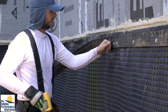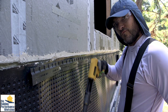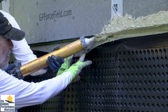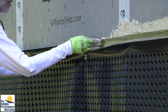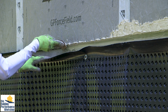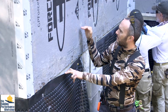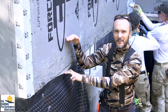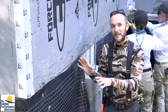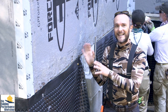But the fastening process of this, which involves a powder-driven nail gun — and it's very fun and very permanent — couldn't be done until we had sealed this seam for air and moisture transport. And this couldn't be done until we had the roof on and the house all dried in so that water wasn't getting in there. Because you could see that in some places the water was getting in, sitting on the floor, and then coming out and soaking these panels. So you can see the bottom portions of these in some places look a little bit beaten up. That's stopped now because the water is not getting into the house.